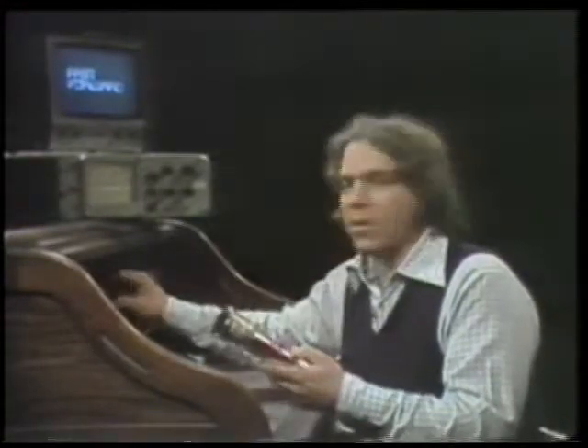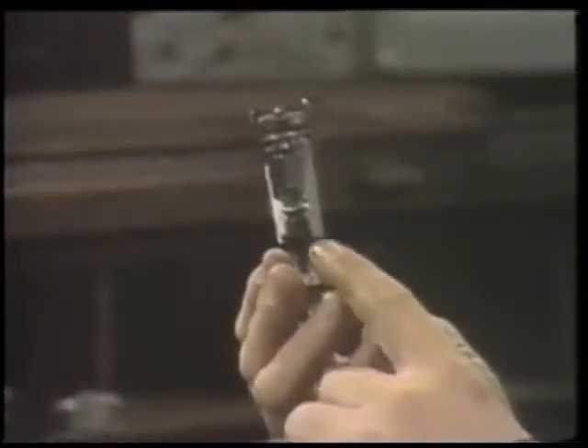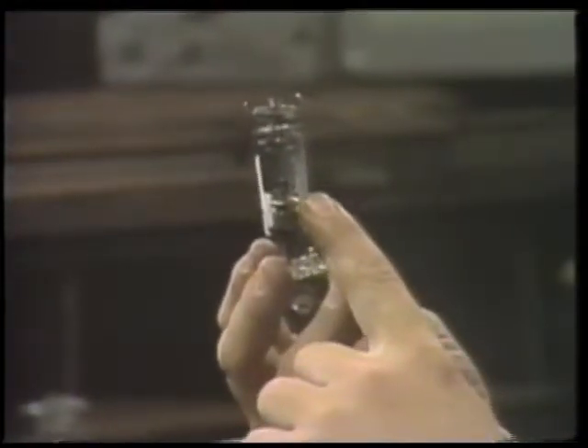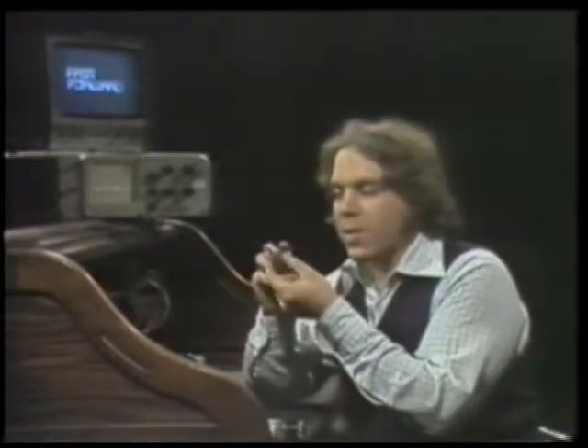The heart of them is an electron gun. This thing's a lot like the good old vacuum tube. It has a hot filament that emits electrons towards a charged metal plate. One of the tricks is that when they get to the plate, there's a little hole in the end they didn't expect, and they all come shooting out in a thin stream. Some other little metal things here attract and repel it and can allow it to be focused into a tiny spot.